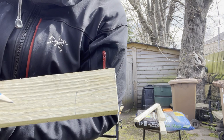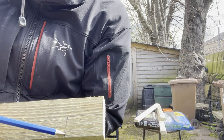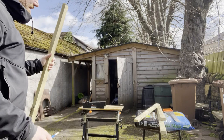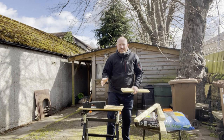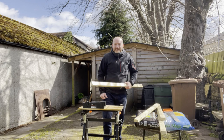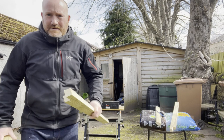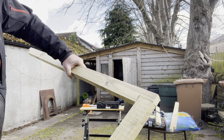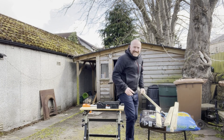Let me bring that over to the camera so you can see it. At this end, we're going to cut out the width of the wood and half the depth — just to cut that notch, so when we put the frame together the shorter piece fits in there nicely. I'll cut one at that end and one at this end, and do the same on the other length of wood. That's the notches cut — the theory is this bit and this bit fit in there, relatively square.